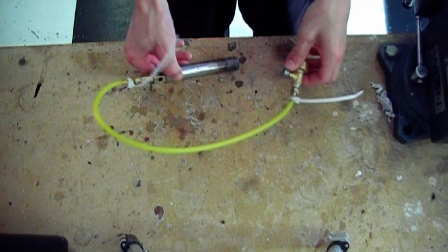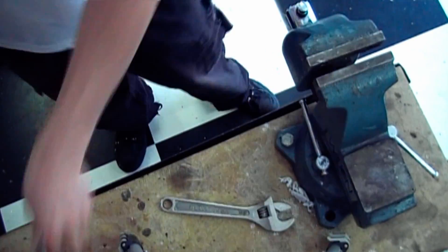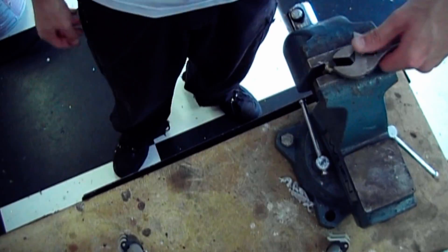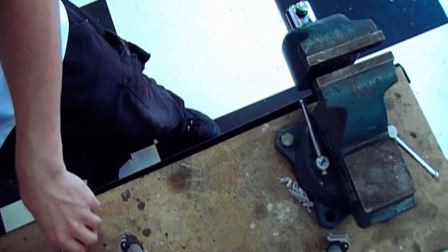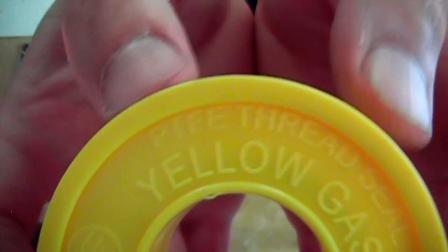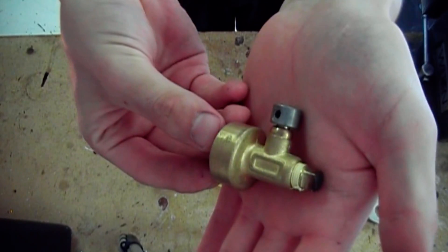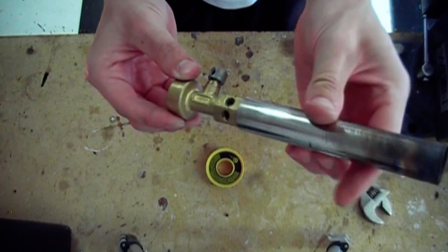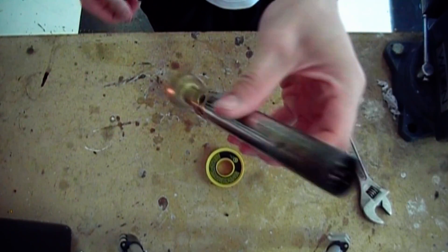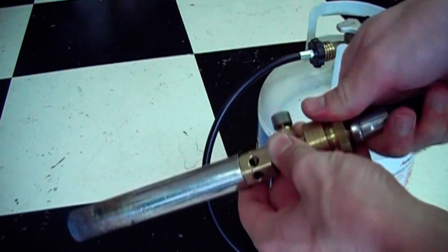I did update the burner for the forge a bit. It would run off of one pound cylinders, but I found the one pound cylinders chilled down too quickly and performance diminished. I've stripped it down to just the blowtorch valve and the orifice plug, which I installed directly into the blowtorch valve with some special Teflon tape made specifically for sealing gas lines. The burner then threads directly onto the valve. Now with the use of an adapter I can use a 20 pound cylinder to run the burner.